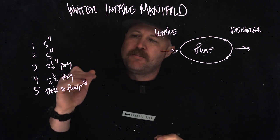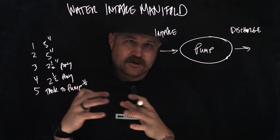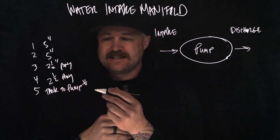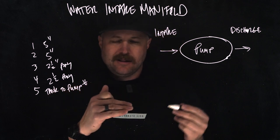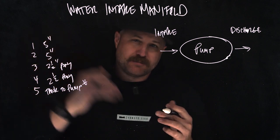It's important to understand that the tank-to-pump is going to function a little bit differently in this illustration because we've got a clapper valve. There should be a clapper valve that prevents water from flowing back into the tank, so water moves one way — from the tank to the pump — and water is prevented from going the opposite direction, which you'll understand as we start talking about how we move water through these pipes.